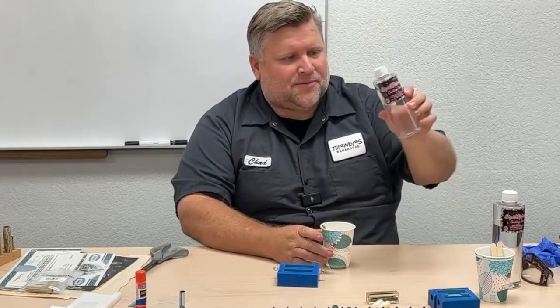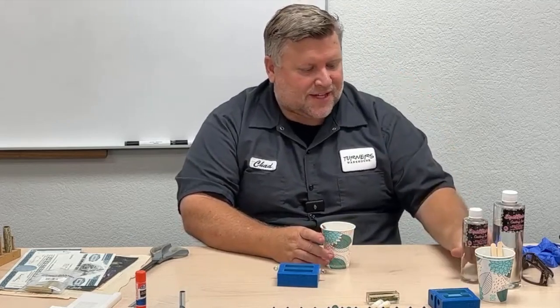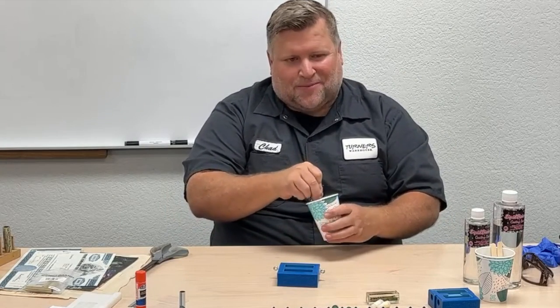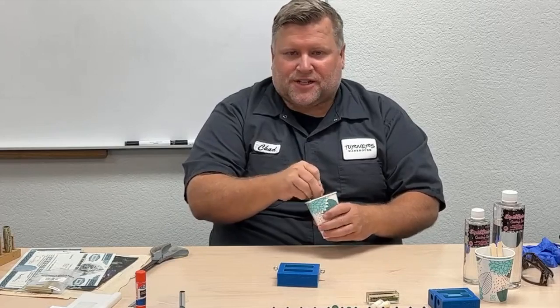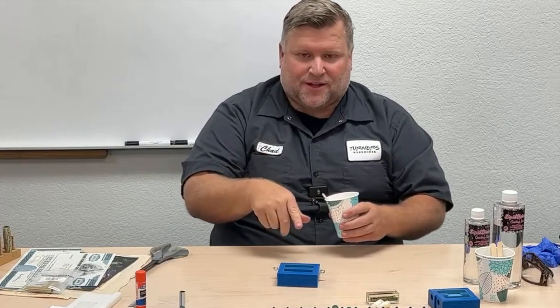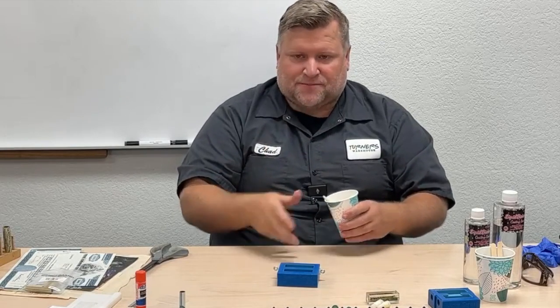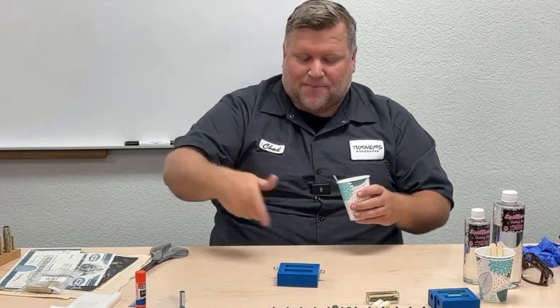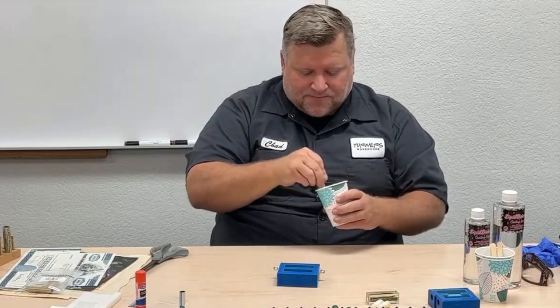I like this one. Like I said, the liquid diamonds is very thin. It's a very thin viscosity, especially once it warms up. So if I wasn't using a pressure pot, I would mix this up. I'd probably let it warm up to 100 degrees or more before I pour it in there. Even though I don't have to wait for the purposes of the pour, by waiting that long, it lets the most air come out of it, and I don't trap air around my piece.